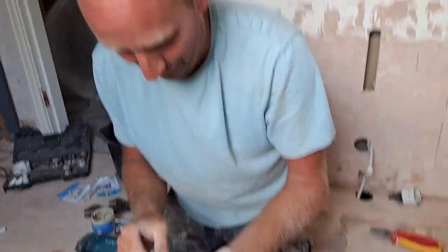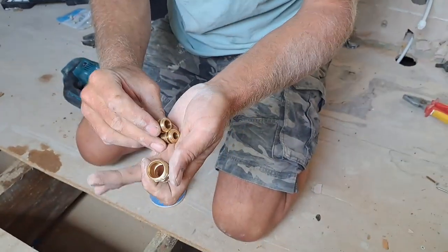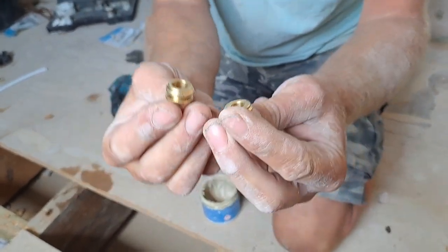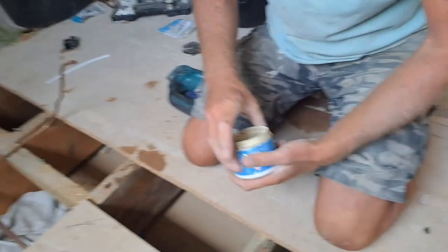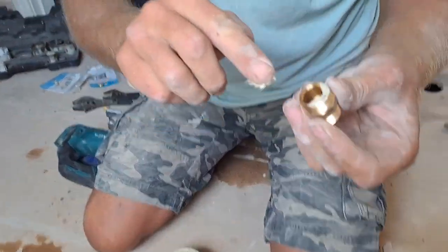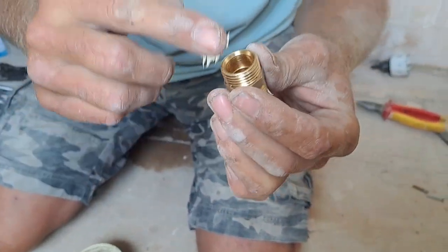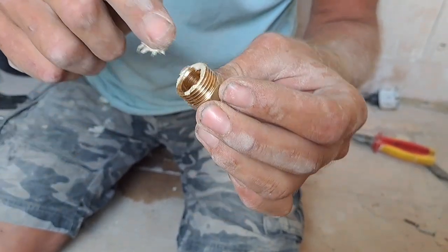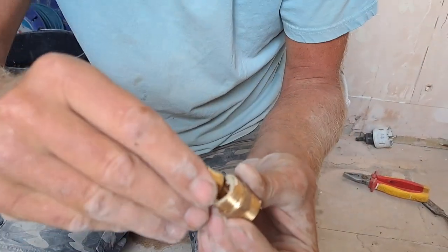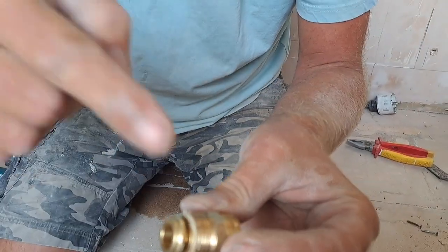Keep your compression nuts — everyone likes a good pair of nuts. And then what you do, you get yourself these magical inserts. One of them is 10mm, one of them is 8mm. What a stupid method, but anyway — get yourself some compound. Be liberal with your compound, rub it round, get it in. Do a ring like that, then do the other side.